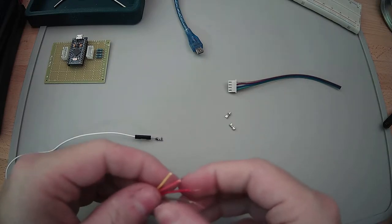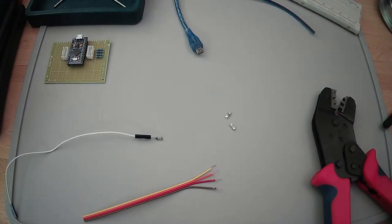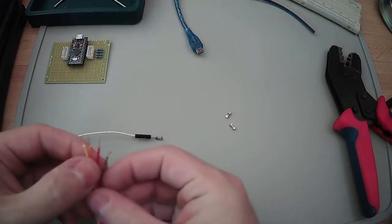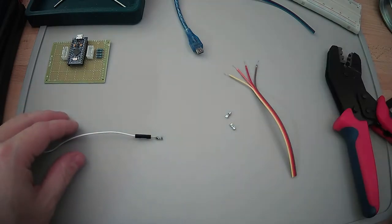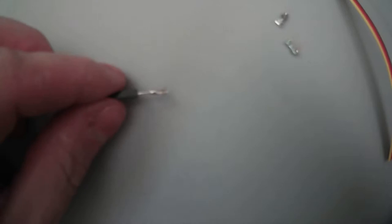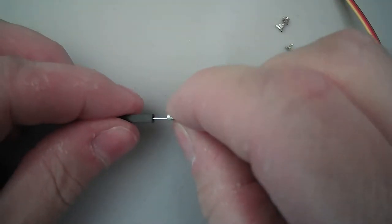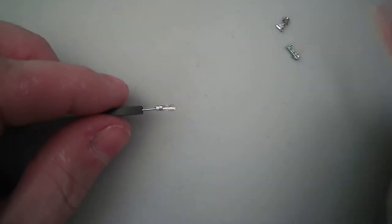Now, when you get done with them after you crimp them, do you solder them as well? Because there has been controversy over people soldering crimp connectors. Some people are adamantly against it. Some people are like, whatever makes it hold. I'm kind of in the camp of, as long as you do it carefully, because especially with these, you don't have much room for error. So I'm going to zoom in here. After you get that wire on here, you have a very small amount of room. It's very hard to even get the soldering iron in there, to be honest.